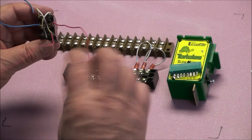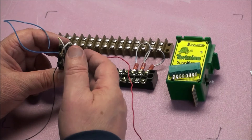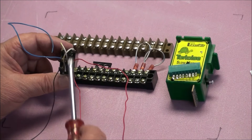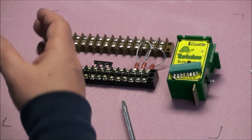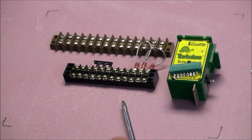Here's how you wire them. If you look at the bottom, there are six terminals. You've got your positive and your negative coming in — all this stuff is DC electric, and these switch machines and your LEDs run on polarity, so all you're doing is reversing the polarity. You have to have a jumper going from this terminal to this terminal, and another one going from this terminal to this terminal. All that does is when you have your toggle switch in one position, it's positive and negative; in the other position, it's negative and positive — so it's just reversed. Then you've got your wires going out to your bi-color LEDs for your control panel, and this will complete one circuit.